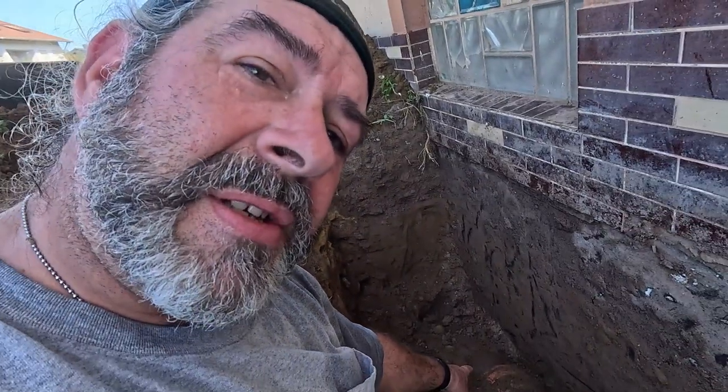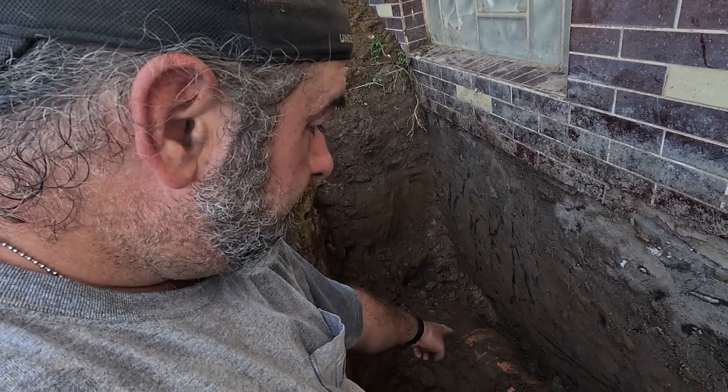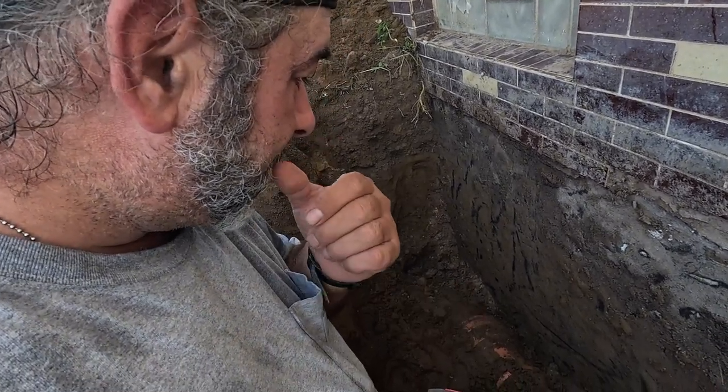It's unfortunate, but I already got water in the basement from one of these lines right here leaking. I'm having a feeling it's right at that junction where the plastic, the PVC pipe meets the stone pipe. I'm willing to bet that's where I have a leak. The fortunate thing is it's being filtered by all this sand before it leaches through the very bottom of the basement wall. With that said, hopefully we'll get this all sealed up. Basement will be bone dry.